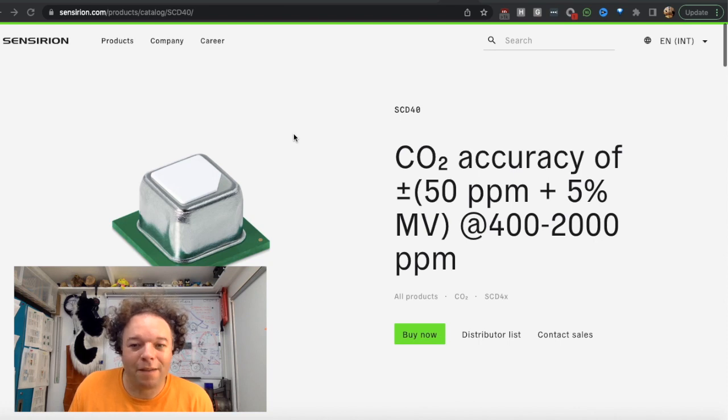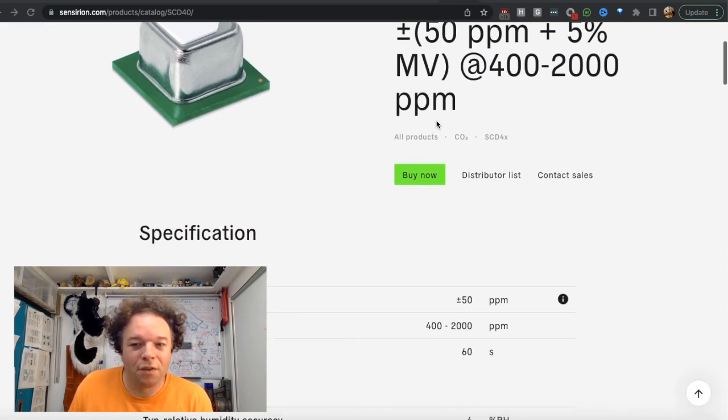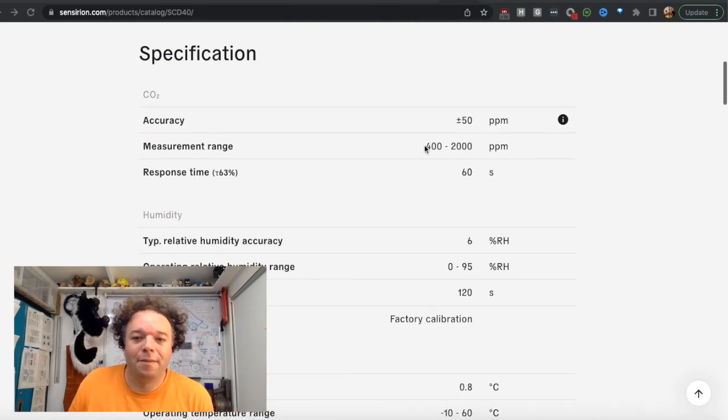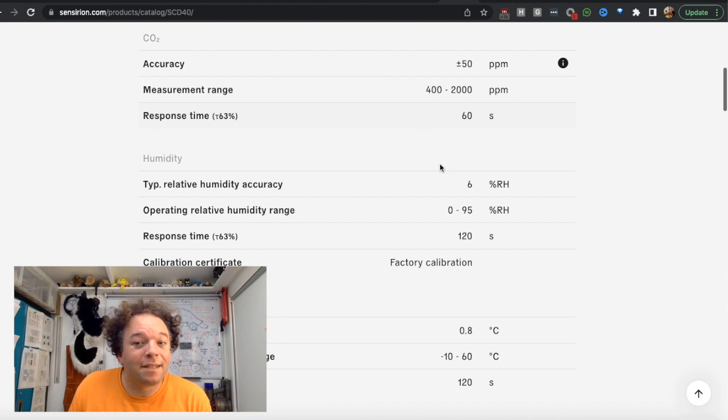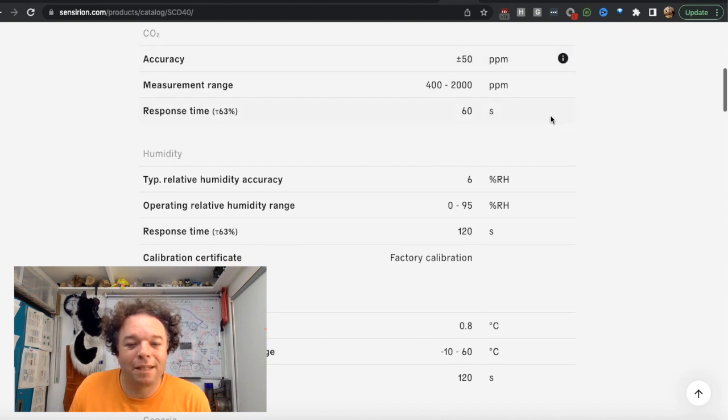So from a designer's perspective, if you go to Sensirion.com, and again, I should point out that this isn't paid or sponsored by them, but genuinely we've seen many, many good reviews online, and we're no different in thinking these were well priced and nice and accurate sensors for our application to do with environmental sensing. The accuracy is plus or minus 50 parts per million, typically in a range of 400 to 2,000 parts per million. And if you're thinking, why not zero? The reason is that, for example, the background CO2 is just a little bit over 400 and actually has been increasing considerably over the years. If you watch any of David Attenborough's documentaries, it's quite alarming actually how fast the CO2 background level is building up. Nonetheless, as you can probably infer, plus or minus 50 parts per million is really quite accurate for something that is, last time I checked, around the high 20s or $30 price range.